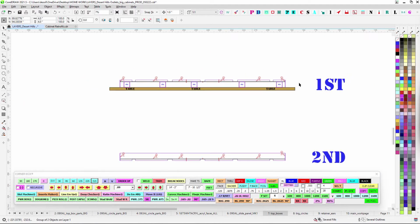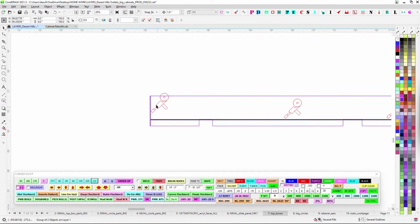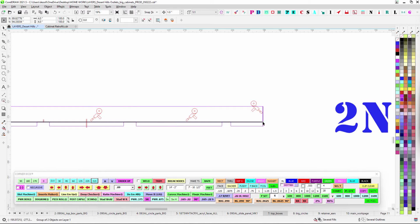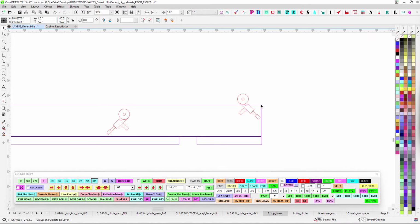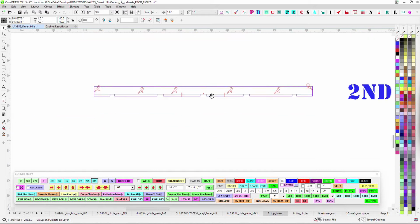Then what you're going to do is, once you get that all done, get it tacked up, then flip it over, and because this is like a regular channel letter, go ahead and weld it up on the inside and close up your seams. So again, that's fine. Weld this up nice and strong.